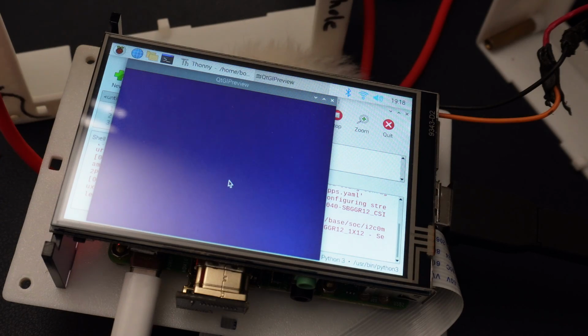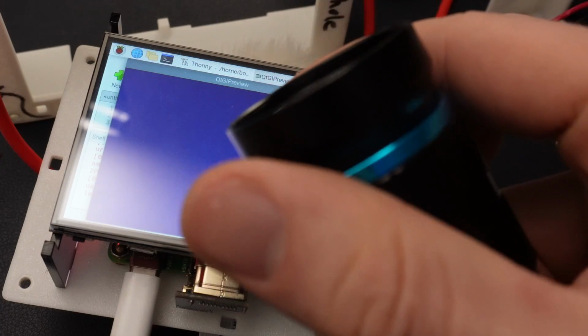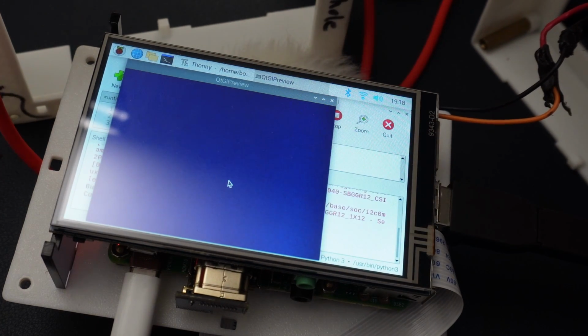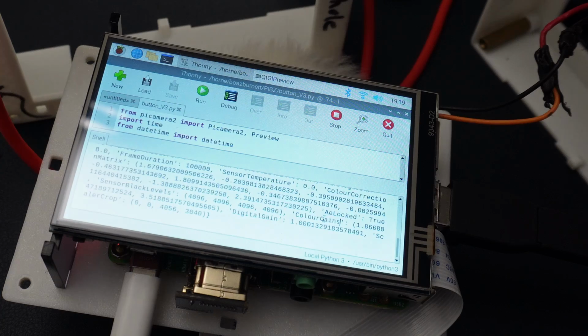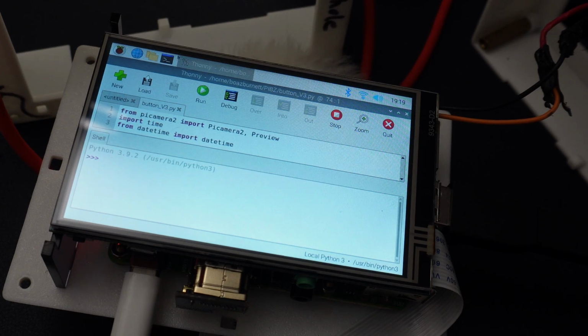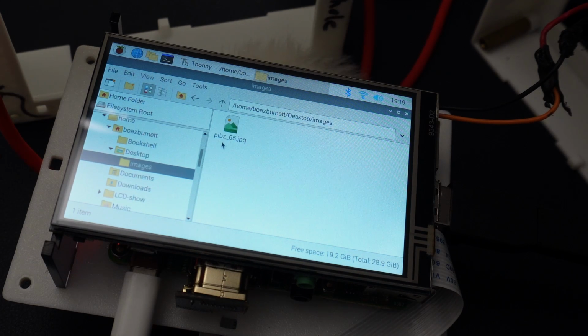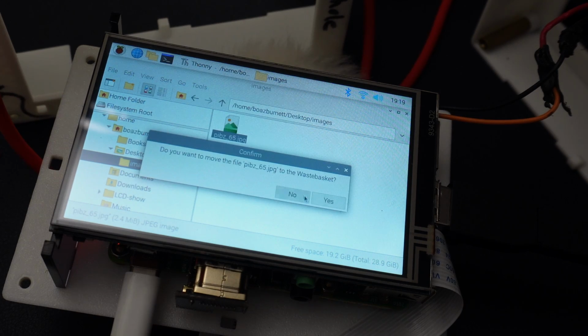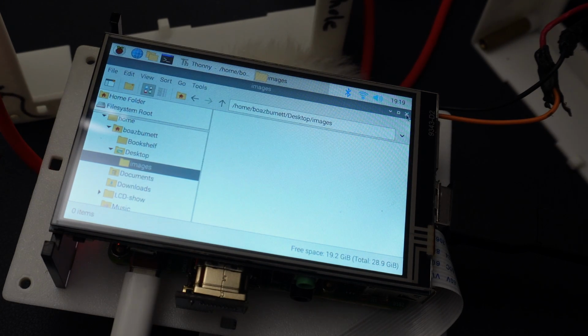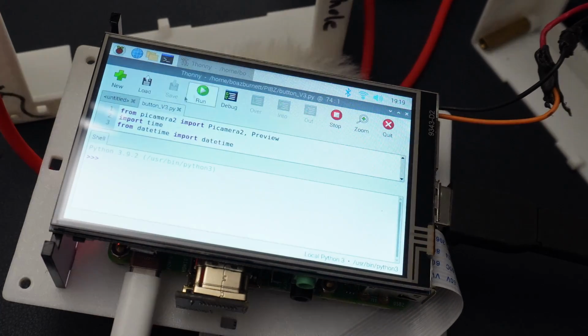And there we have a preview window. It doesn't have the lens attached currently, so that's not going to display properly, but what we can test is pushing the shutter button. And you can see inside of this window here that we did actually capture a picture. So if you want to see what we captured, you can push Stop, and then going back to your File Explorer, and then Desktop, you can see your Images folder, and you can see right here that says 65. So I'm going to actually delete this photo. I'm going to show you how to change it so it has a proper number for you. And this is also going to be available just on your desktop. So there's now going to be an images folder there to hold all your images.